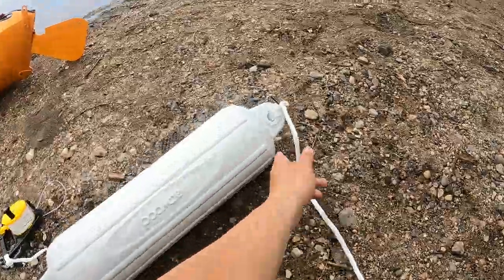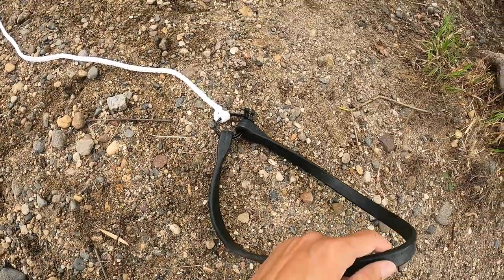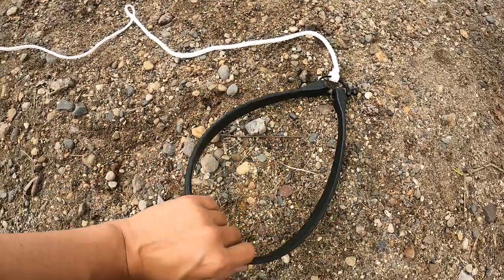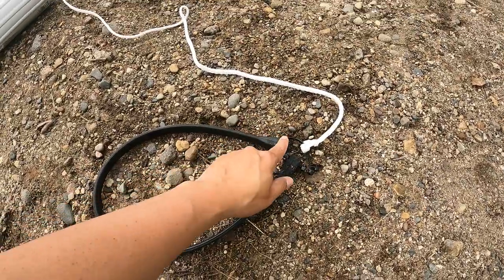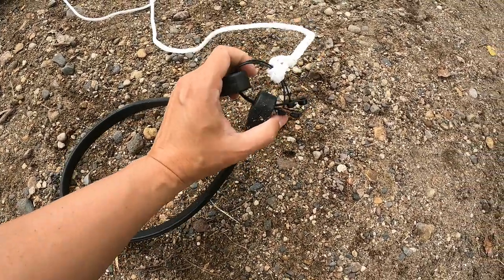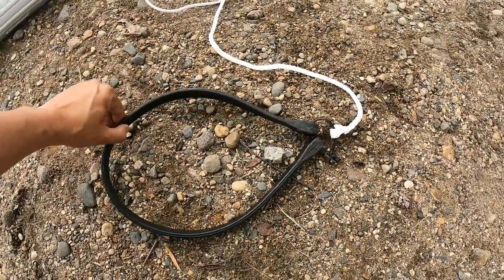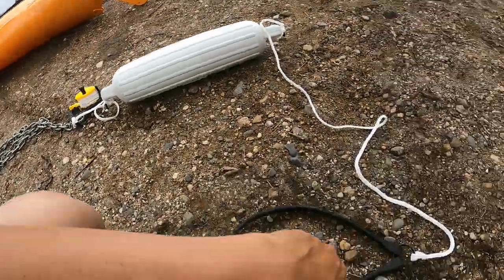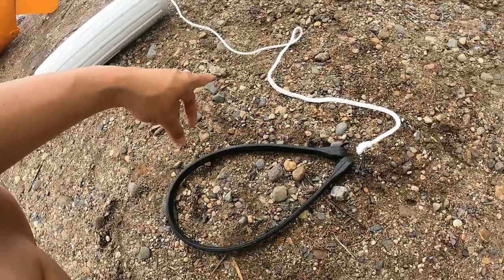The final part is to connect the other end of the buoy line — about four to five feet — to a rubber strap, basically a bungee-like rubber strap that stretches very well. It originally had S-hooks at the edges, but I found those hard to use, so I connected two zip ties to the line instead. This is to provide some stretch — if the anchor pulls on the boat, you have something elastic to absorb the shock so you don't get violent jerks as your anchor drags or if the wind is blowing you away.